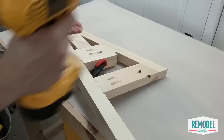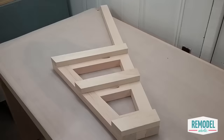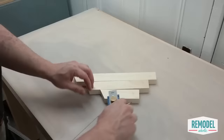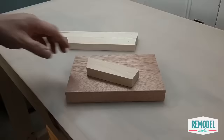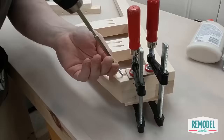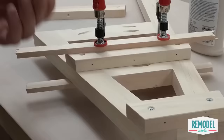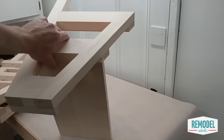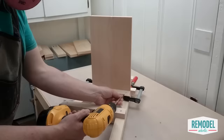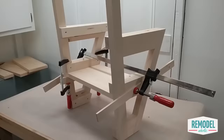The link is in the description box below. Cut the cleats and measure and mark to drill countersink holes in each cleat, which will later be used to attach the seat and steps. Drill additional countersink holes, then attach the top, middle, and bottom cleats to the legs. Assemble the middle step and cut it to size with the table saw. Attach it to the cleats on each leg using the countersink holes.